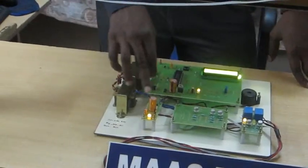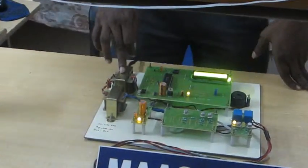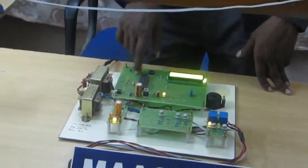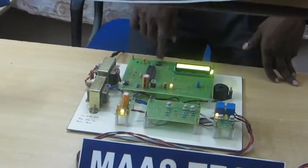This is the power supply. One is a 12-volt power supply for the pump and air system; another is a 5-volt power supply for the microcontroller and LCD. This is the master clear circuit and power-on circuit.